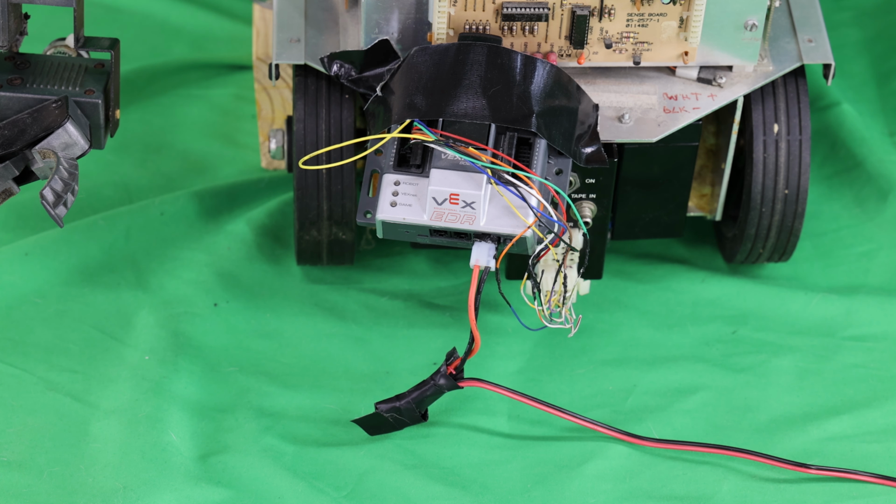with the unipolar. And then I upgraded another Hero 1 robot to use a bipolar stepper motor controller. This is the one that's actually used in most 3D printers sold to hobbyists. But they're very precise, uses the Ramps 1.4 board. And that can micro-step the stepper motors to 1/32 of a step. So doing that, you can have a Hero 1 robot performing surgery. That's how accurate it is.